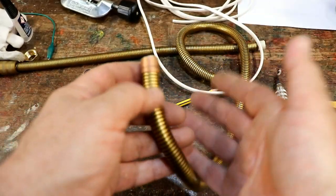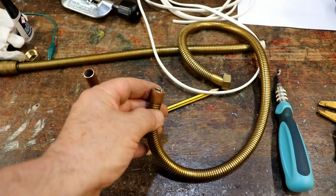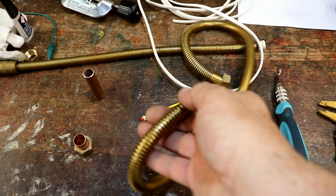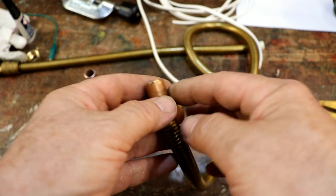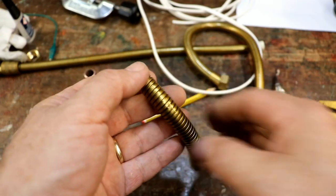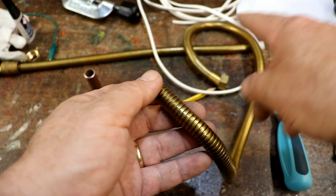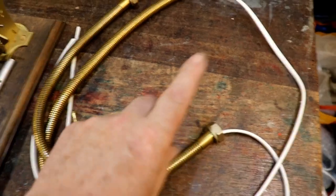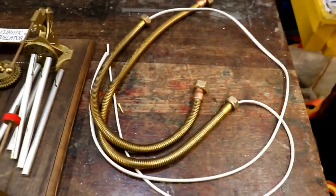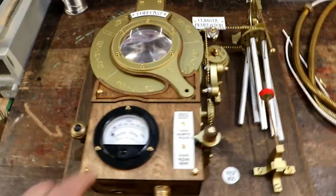This shows you how brilliant this antique shower hose is — it's absolutely made for this. If you shop around on Amazon and eBay you'll find it for about £35, but if you keep searching you can find it for about £5.50 each. If the antique look is right, you get a lovely piece of rubber tube you can take out of the middle. One thing to remember when gluing them together: don't forget to get all the captive fittings on first — you know from experience it's a beautiful job, but then you have to take it all to pieces.